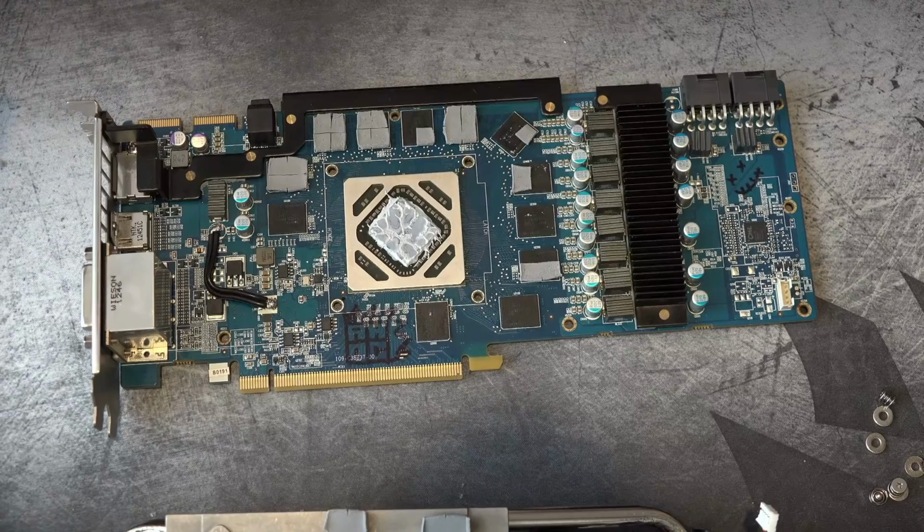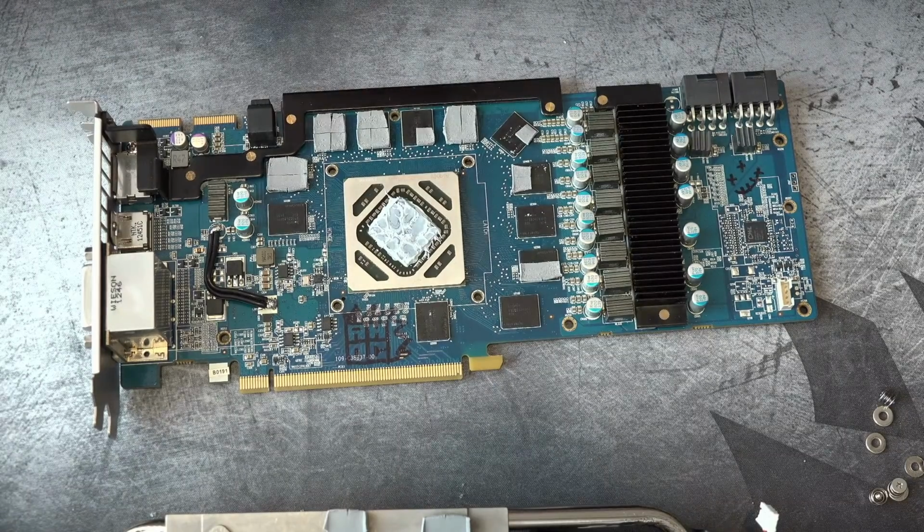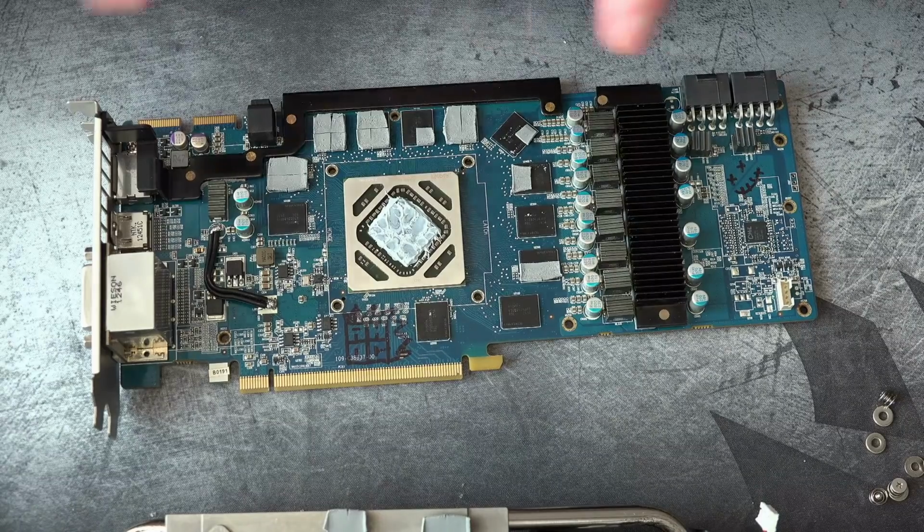There's not that many ways to do that. So, there's some voltage controllers out there. If you have a data sheet, you can straight up just adjust the current limit. They're going to have a pin. You can adjust the current limit. That's really cool. Then there's digital controllers where you'd have to program the current limit, which would be a pain.